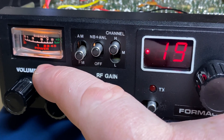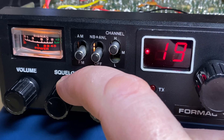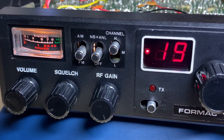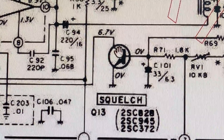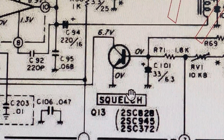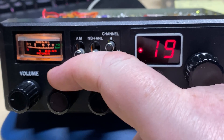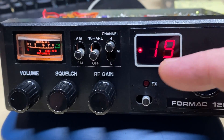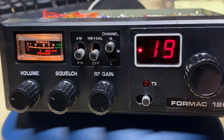So next, let's have a look at this popping squelch - this should be easy enough to fix. We're going to fit a capacitor across this transistor, collector to emitter, just to hold it a little bit when it switches off. There we go - nice and smooth on the release and no pop anymore. Squelch still works as expected but no nasty pop.